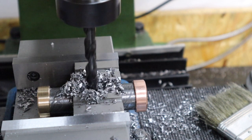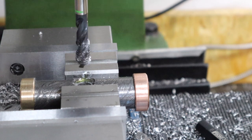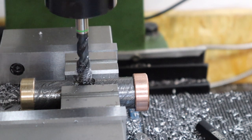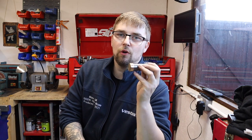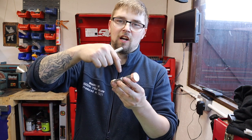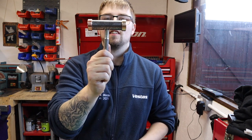Knowing how this Damascus steel drills, it's actually a really nice operation. But this is where things went wrong — deciding to power tap into the workpiece. As you'll see, I was doing the final operation on the hammer head, power tapping down, and the workpiece decided to lift up out of the vice. Not ideal, but luckily I managed to save it, took it over to the bench, and finished it off with a hand tap since it had only gone in about half a turn. We've now got a machinist hammer head threaded and ready to accept a handle.